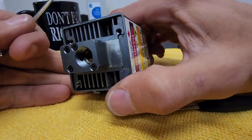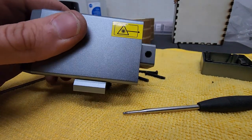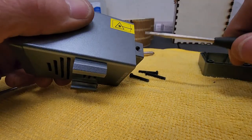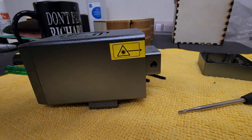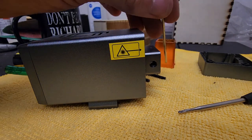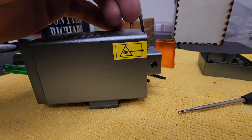It was all the way in and it's very difficult — really difficult to see what's in that hole when you're assembling. I've still got some debris built up in there; I'll have to clean that out better. But you pull that out and that'll actually allow your air assist, instead of flowing all the way down through your shield because it has nowhere else to go, to funnel in through your actual nozzle.